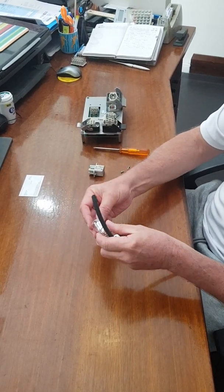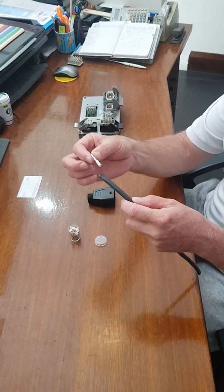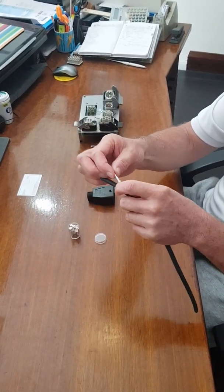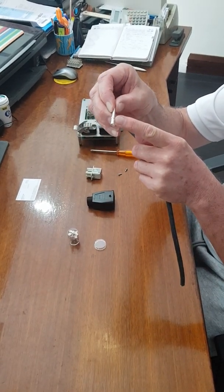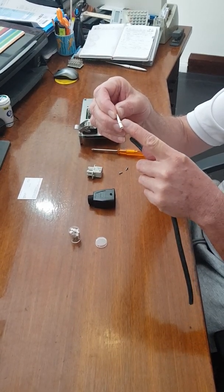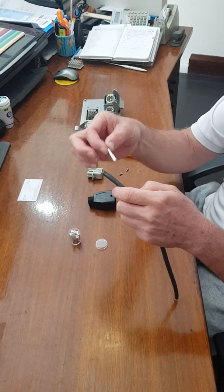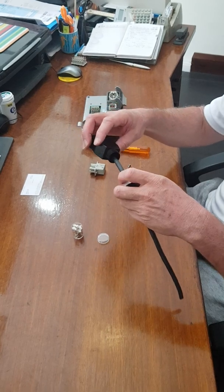This is just for demonstration — obviously you'd strip your insulation back and put your five crimp pins on and hand crimp them. It's good to note there's a small little hole in the crimp pin, and that's a viewing hole so you know you've put the stripped cable right back into the recess where it needs to go. So you crimp them on.